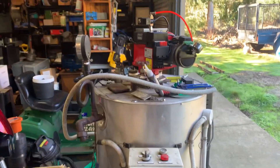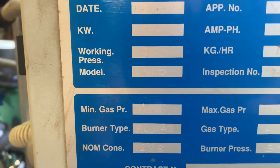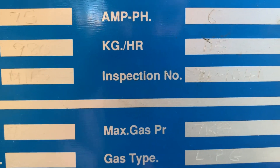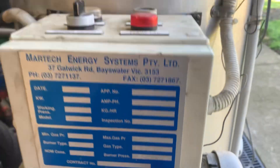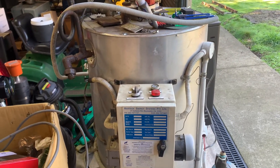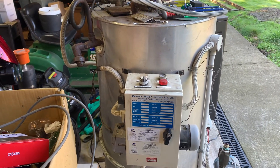It's a top fired boiler — Martek Energy Systems, 75 kilowatts, 115 kilograms an hour of steam. These boilers are what they call a tubeless boiler. They've basically got various heating surfaces inside them and a fairly low water volume, so they steam up really fast.